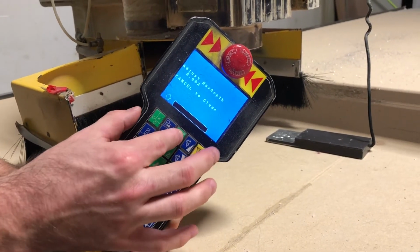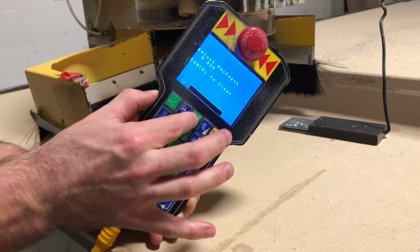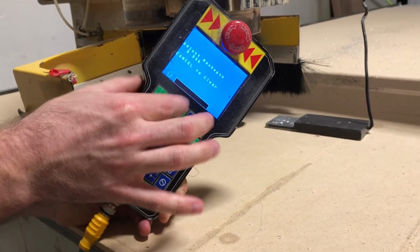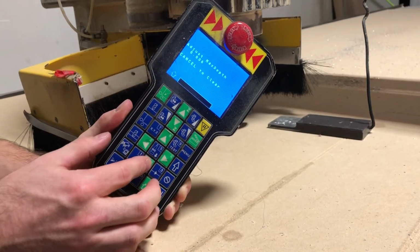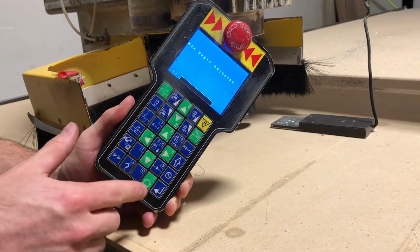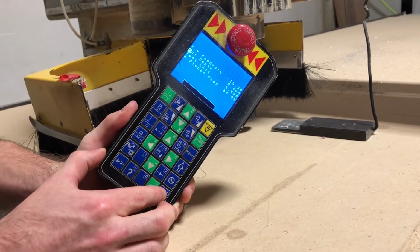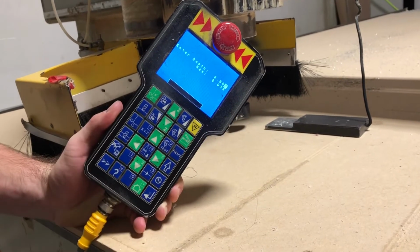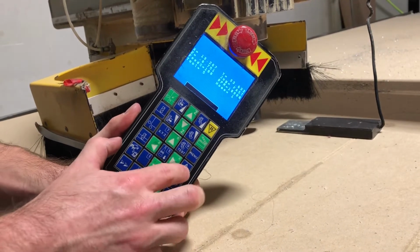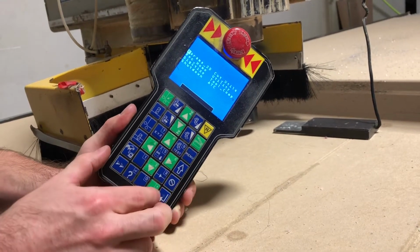So we're going to set it to do about 3 thousandths. Actually, you know what? Let's do 0.35. Or I'm sorry, 30 thousandths with a 5 thousandths, so 35 thousandths, my bad. I'm going to press enter. Now, if we go back and look at our Params 2D, press enter, go to cut depth, it is shown that we're at 0.34, so it's in the ballpark. Did I set that to 0.35? Yeah, okay. So that will be our cut tolerance.